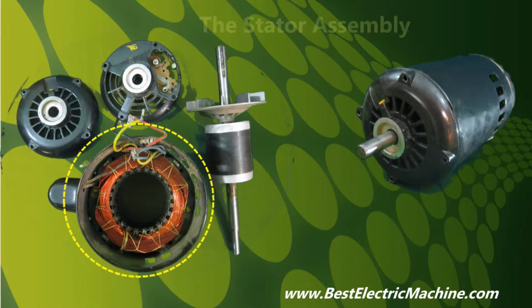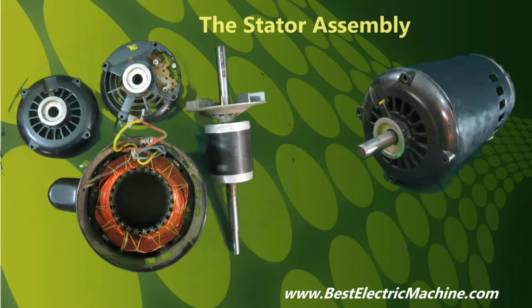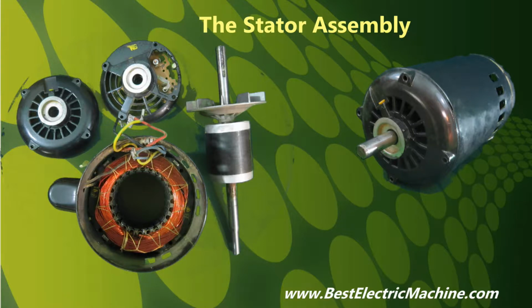First component, the stator or stationary assembly, includes a balanced multiphase AC winding set that is excited with bidirectional multiphase AC electrical power directly through its terminals. Only a balanced multiphase AC winding set, which is independently excited with multiphase bidirectional power directly through its terminals, i.e., active winding set, produces a rotating magnetic field relative to its frame that does real work, by actively contributing electrical power to the electrical to mechanical, or electromechanical, conversion process.